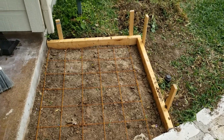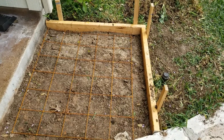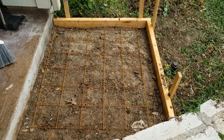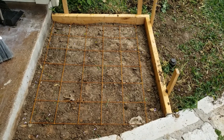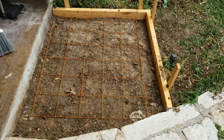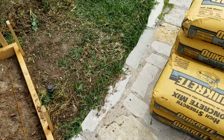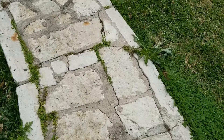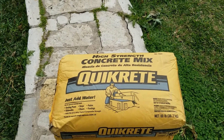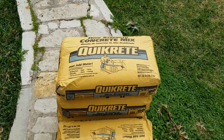I'm back and it looks like I've got the sprinkler head moved. I've got everything framed and ready to go, formed for the concrete. I put a little wire in to help strengthen the pad — you don't have to, but I want it to last and I really don't want it to crack. It doesn't cost much for some wire; you can pick it up at Home Depot. I'm also using Quikrete — this is a high-strength 4,000 PSI concrete mix. Just add water and mix, and I'm going to do that in my wheelbarrow.